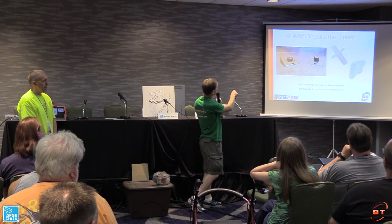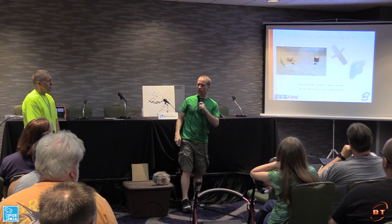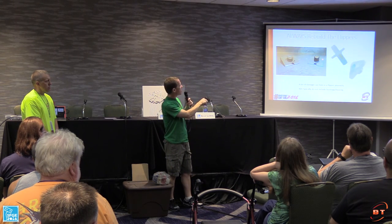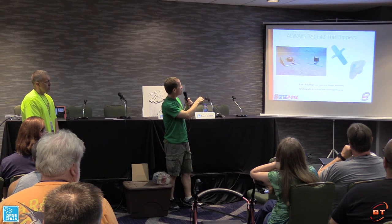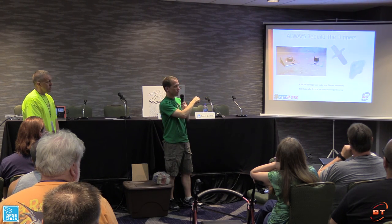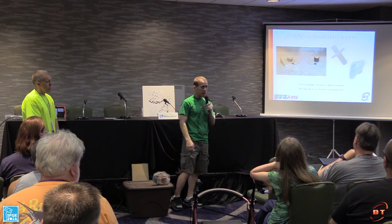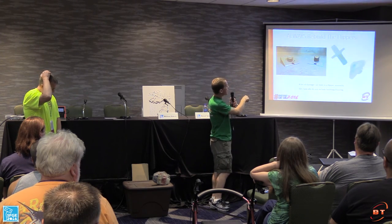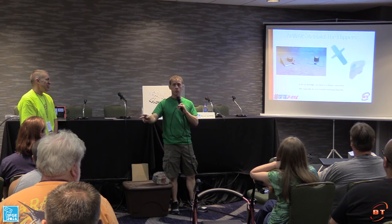Now, here's a good example of something hiding. You might play the game and think, okay, these flippers are pretty strong. It's a good game. It's got good feel. Well, this is a coil stop, a good coil stop on there, or relatively good. It's got a little wear. This coil stop has just been used and abused. It's mushroomed. It's just been beat. And if that piece of metal has been beat to that point, you know all the rest of it is due, because the majority of it is plastic parts.